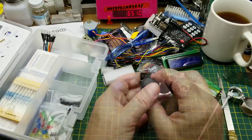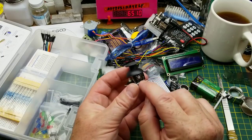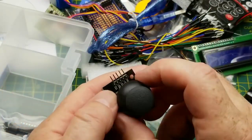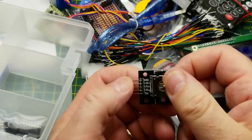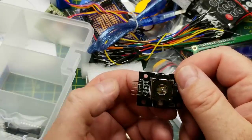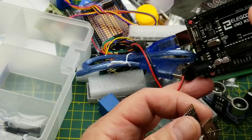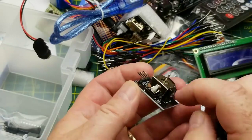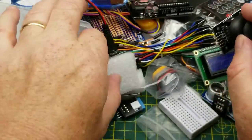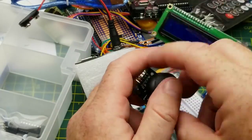We have a little joystick and knob, very similar to those found in typical game controllers. It has two potentiometers built in — one for horizontal, one for vertical — and a little clicky switch button when you push down. You connect ground and five volts, variable resistor X and Y to a pair of analog inputs on the Arduino (there are six analog inputs), and the switch button to a digital input. You can create your own game or use it for cursor control on a display.